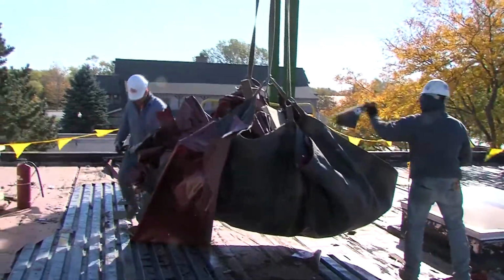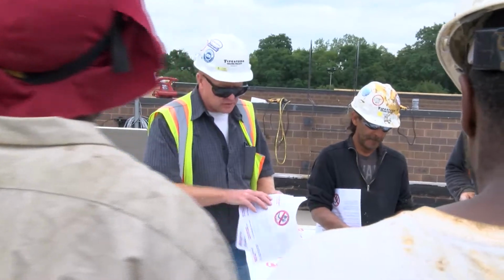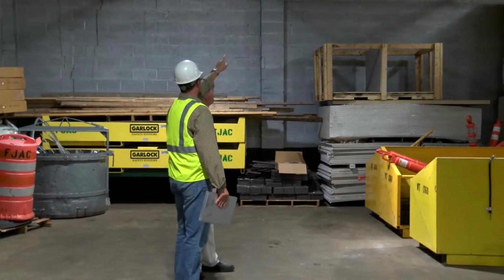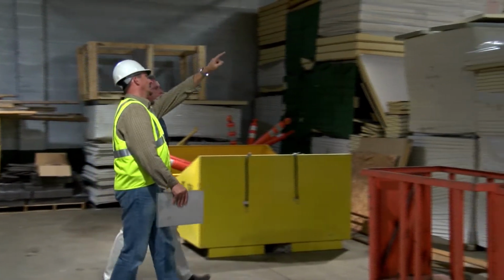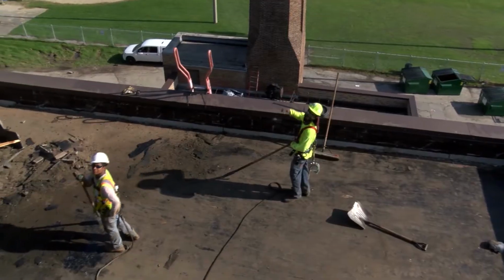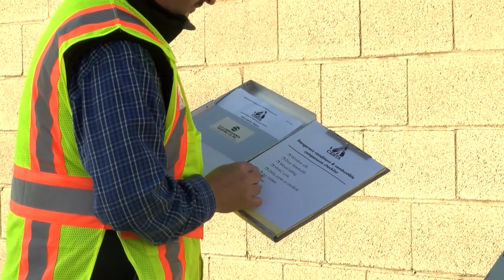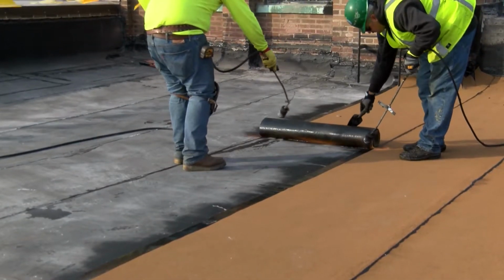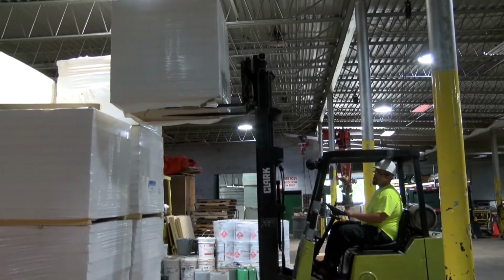In addition, supervisors need to be aware of the local fire code and safety regulations and ensure their crews comply with those rules. Inspect daily with the building owner or their representative for conditions that might present hazards during torching operations, such as flammable and combustible materials stored under the roof deck, in attic space, or adjacent to the building. The inspections must be done on a daily basis since conditions may change, particularly in fully operational buildings. Inform the building owner of the need to relocate or protect those materials.